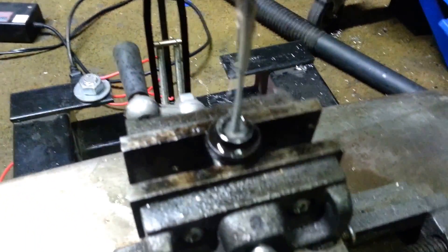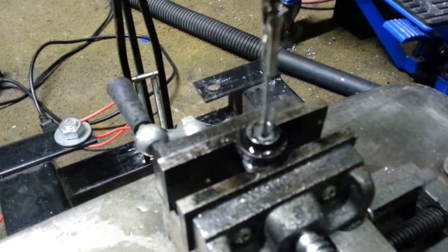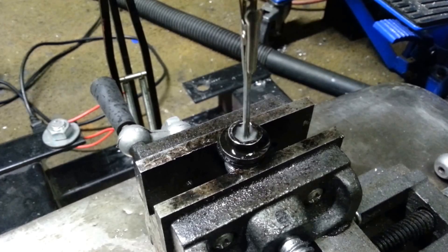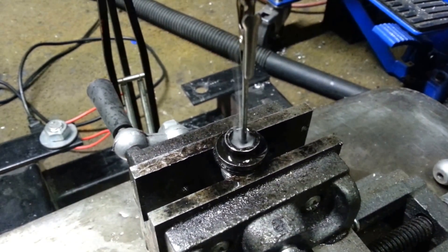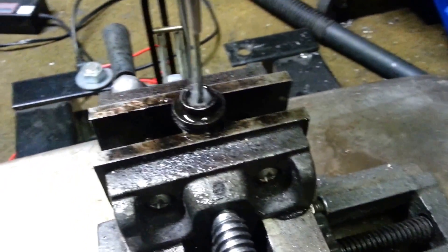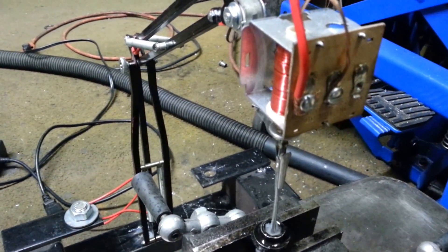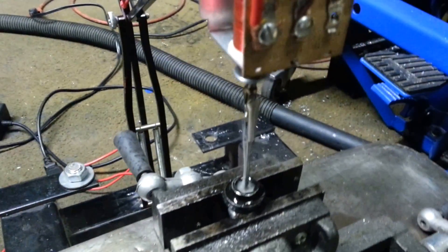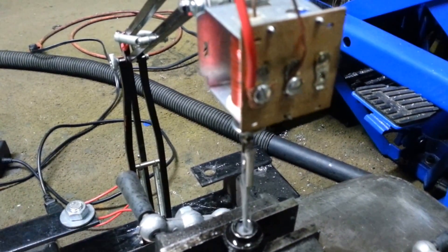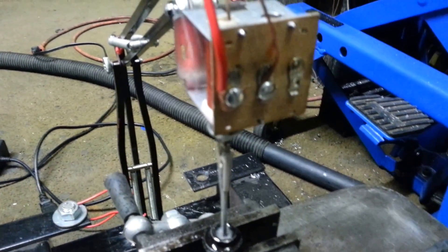If you cut an outline of a shape that you're turning on a lathe — say, a hemispherical profile — you can EDM that part based on that profile, and then just turn the part and EDM it away. That's a very popular system for aviation. They use a lot of EDM-created parts there. There's wire EDM, and this is called small hole EDM for obvious reasons, but they use small hole EDM for making a lot of precise parts using dies that have to be machined first.